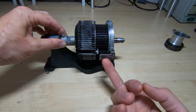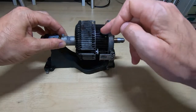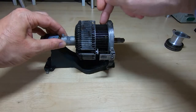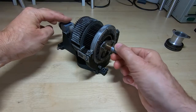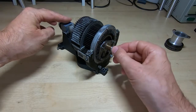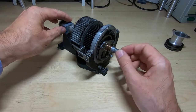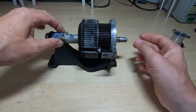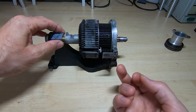So in other words, when the lever is in a certain combination, then the slots line up for one of these levers. That lever can then drop down into the slots. That then causes this arm to stop in a particular position when it hits that particular lever. That stops the print head in that position, and the character has been selected. So in other words, the position the head stops in is dependent on what the combination is that's set on these pins.